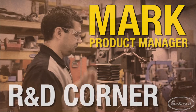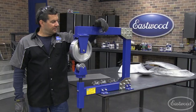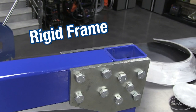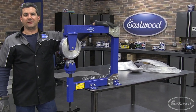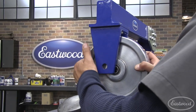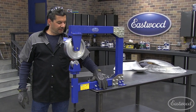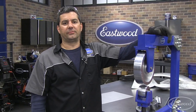Let's go over some of the features of this machine. Some of the things that make this the best, most affordable unit on the market today in the benchtop size. First thing you can see is the rigid frame. We've got these doublers on here, all structurally bolted together so that you have no flex. Don't trust a $200 welded rectangular tube wheel. Second, you can index both your main 8-inch wheel and your anvils 90 degrees, so you can work your material for larger pieces. This both saves space in your placement on the workshop. Also, it can be bolted to the bench or simply clamped in a vise, making it very portable.